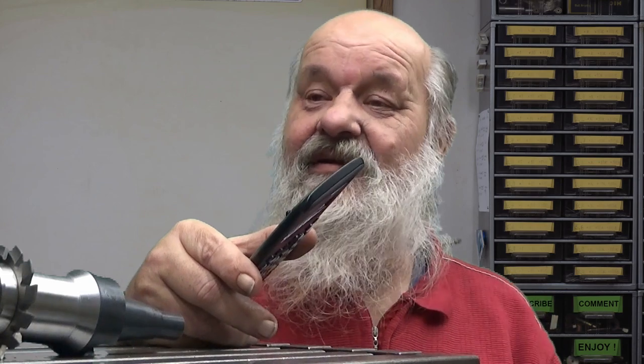Well, how did I come to this? There is no direct mathematics on how you can come to that. To me, it's trial and error, really. You can try to minimize your calculations, but I have developed some sort of a gut feeling of which would probably be the correct disk. It's a little bit intuitive. Anyway, now we know that it will be a 19-hole disk and each tooth will be 8 holes.